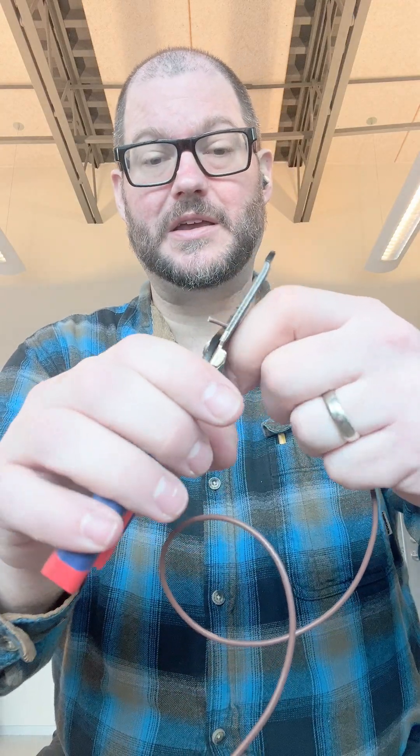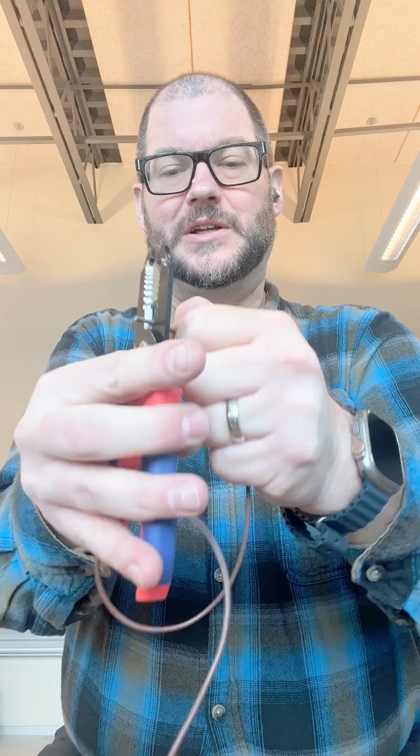So how is crimping supposed to be done? First, we're going to take some wire and use the cutters to cut the end off so we start fresh. Safety glasses are recommended. Now, a lot of people think that wire cutters are the only tool you really need — that you can just cut around the wire in a circle and pull the end off to get some exposed stranded wire. In a pinch, you could do this for a hobby or prototyping environment, but if you're building something that goes out to the field, this is a problem.